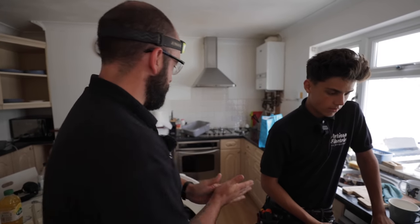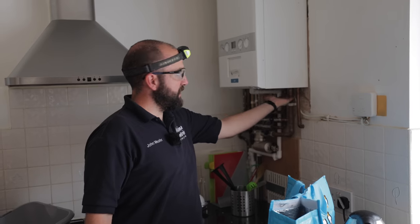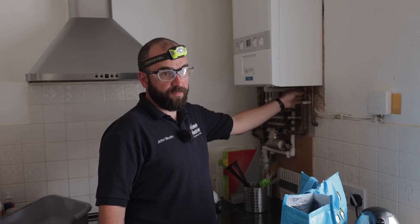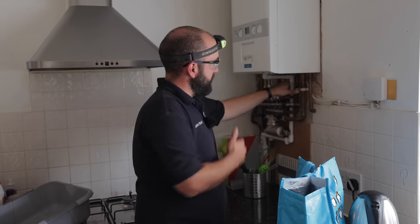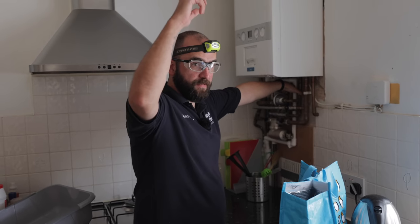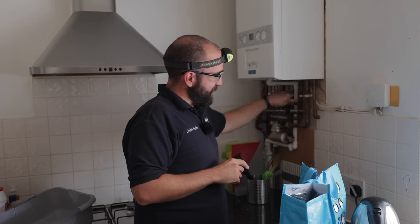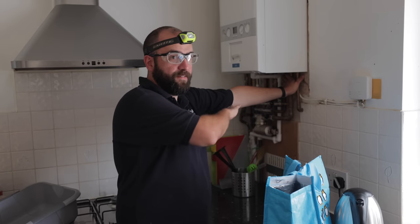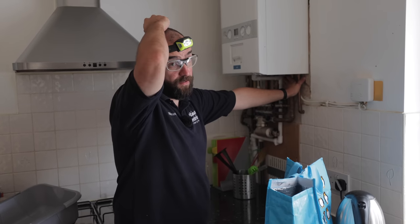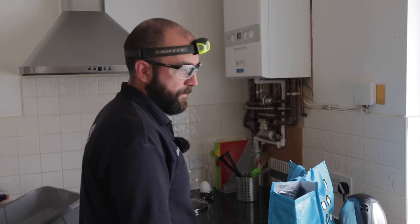Yeah. So if we go over here, right, we've got a lovely boiler. One of these pipes is connected into it, and they both have the gas and the water have bonds on them. Yeah. So they're cross-connected here. It's like a big junction box. It'll be the same up in the... Actually, there ain't an immersion cupboard here, but if there was, there would be. Yeah. So this is connected to the ring, and now you've got all of these connected and going back to the consumer unit. So yeah, there's another path back. So it's a bit lower. Mm. So there's our target, 0.25.